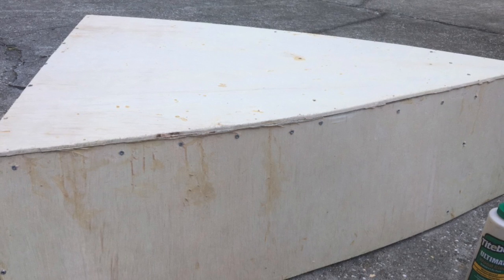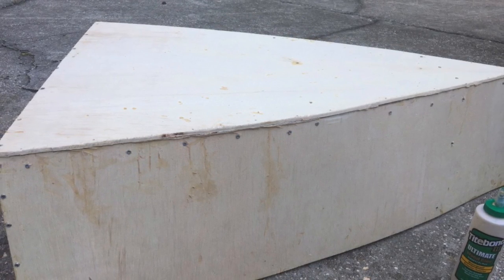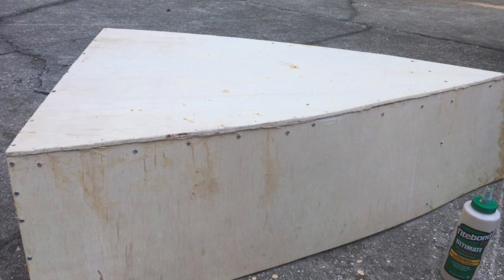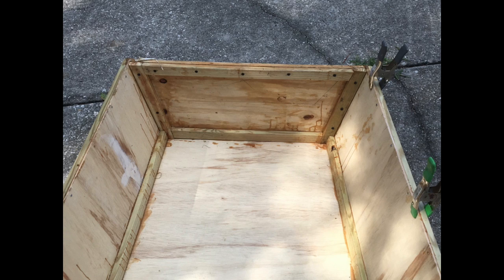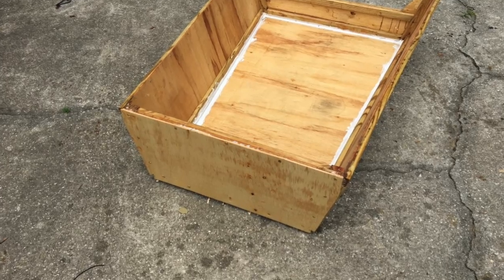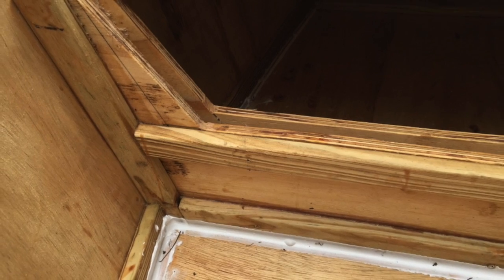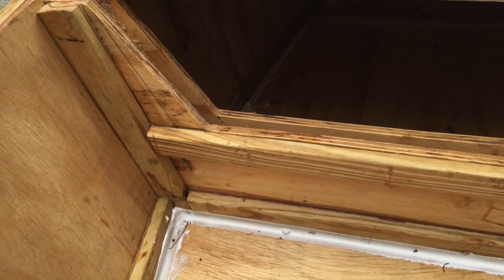After fiberglassing, you're going to want to do a water seal. I would suggest Thompson's water seal, but perhaps a varnish for the bottom of the boat. Either way, you need two coats. You can get an idea of how I placed the rails here, and next you just caulk the heck out of the boat, both parts. There's another close-up of the rails I used.